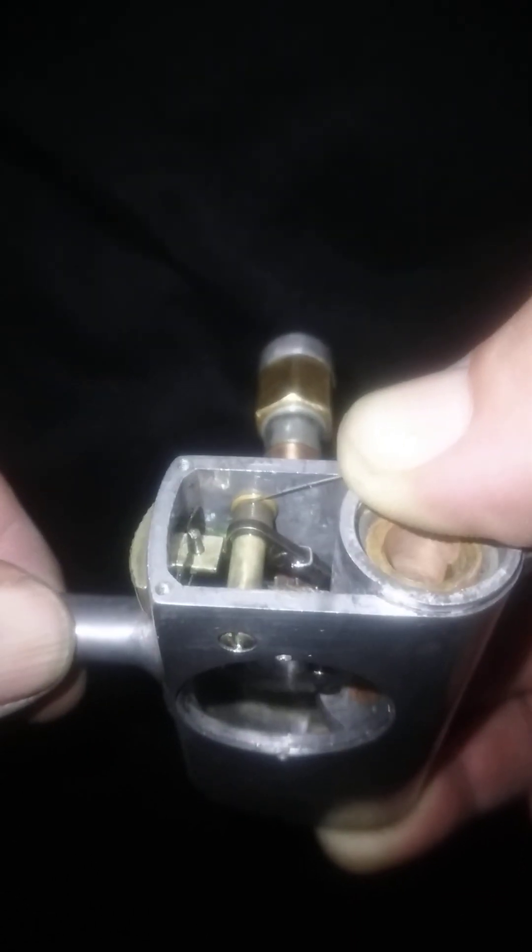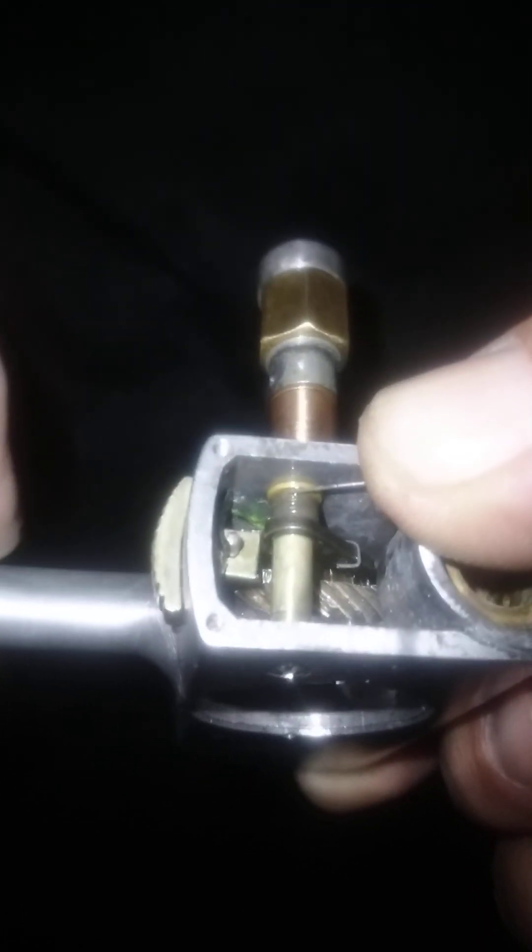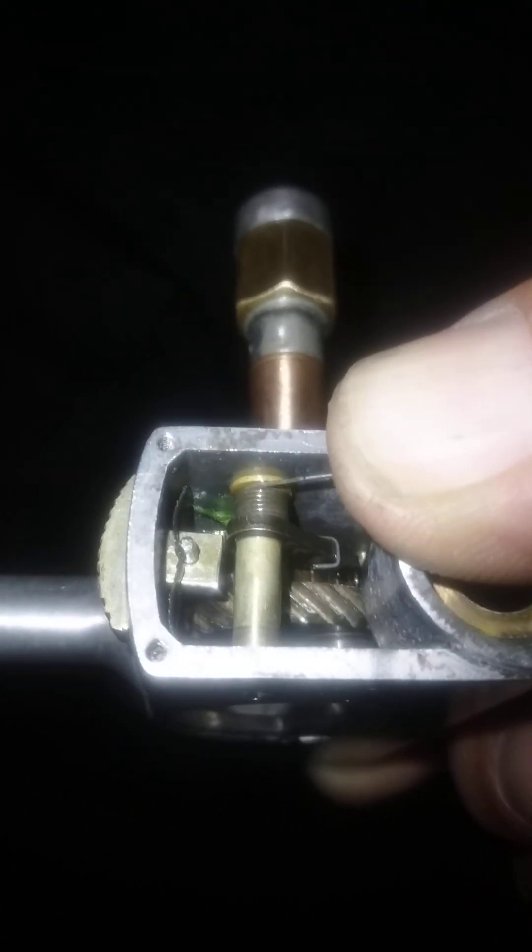The other part of the spring is right here under my thumb. When the dust cover actually engages it — when you put that dust cover on, it puts tension on that spring, and you see that spring engages that pawl foot and pushes it up against the inner gear. But right now you can see that selector switch is missing that top foot of the pawl, so it's allowing it to just be free in there.